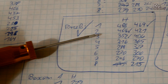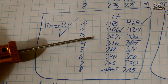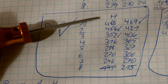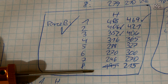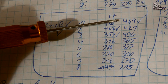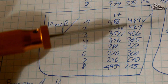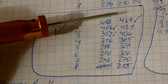The RaceBand, which many of you may be using if you have the new RaceBand receivers, shows some interesting stuff. This might be worth consideration if you're racing — you should try to get one of the highest rated channels to have some advantage over your buddies. Here again it's the first and second measurement, which differ a bit. The spread is 469 versus 215 milliwatts — that's half the power difference between channels.